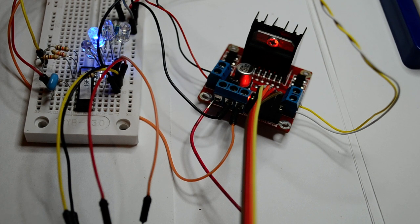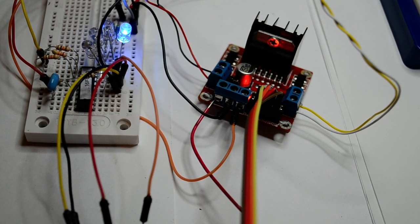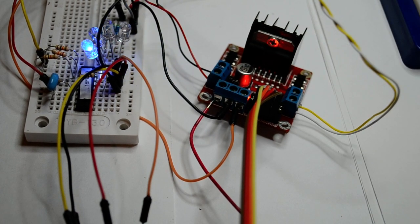I'm going to start moving the camera unnecessarily. Well, you've got the 298. ST talk about driving the 298 with a 297. So I looked at the 297. I thought, right, what do we need? What does the 297 drive the 298 with? And it's 4 clock pulses.